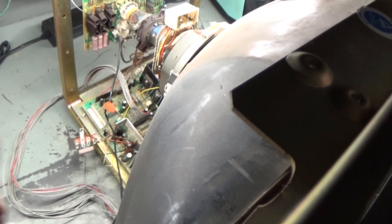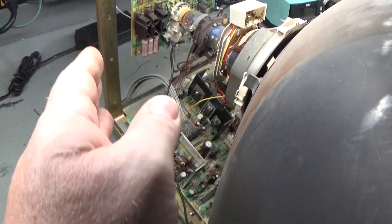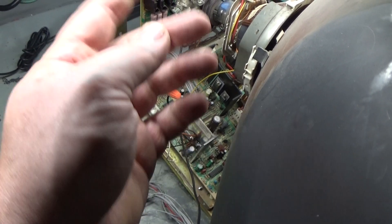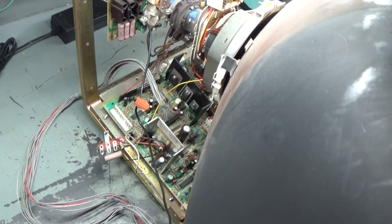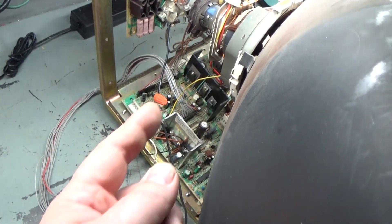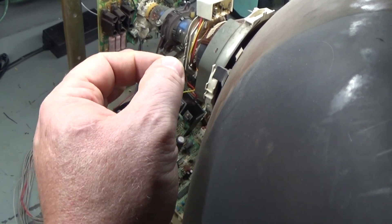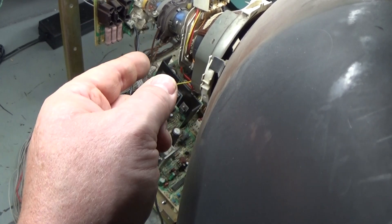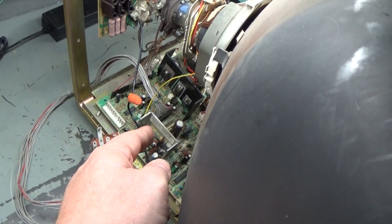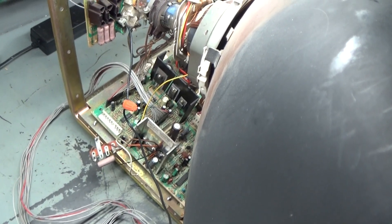I've shown all that in other videos. I'll clean up the contacts and reflow the solder onto the traces, do the neckboard repair, put this back on with the new flyback, cap kit, reflow, and neckboard repair, and see if we can increase our odds of having this fixed. The flyback is what outputs the voltage — there's a pin off the flyback that goes right to R303, from R303 to D302, and then over to the vertical deflection. If that voltage is not present or the flyback is faulty, it won't generate the vertical deflection.